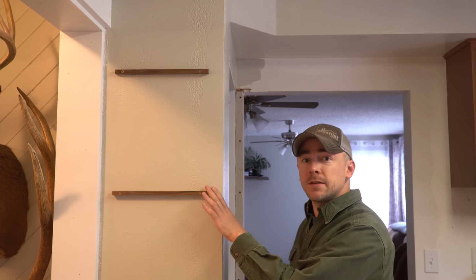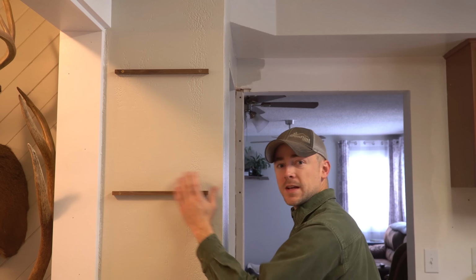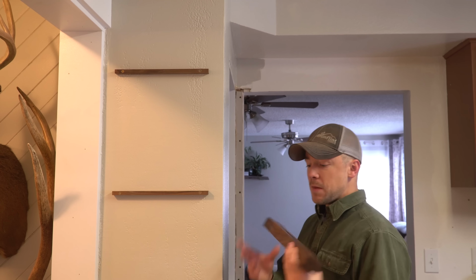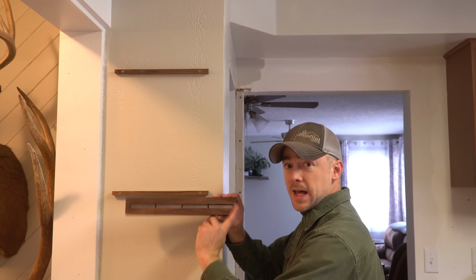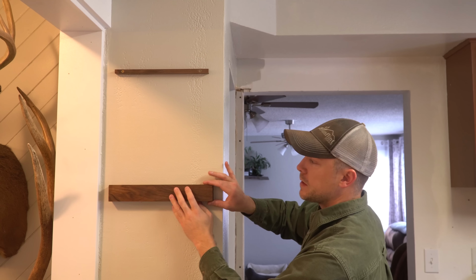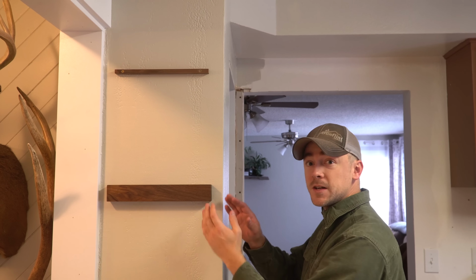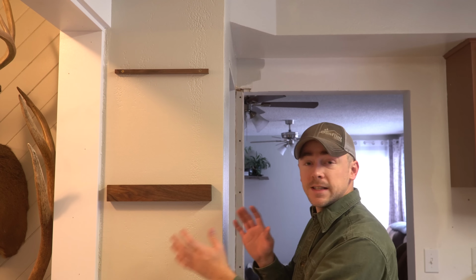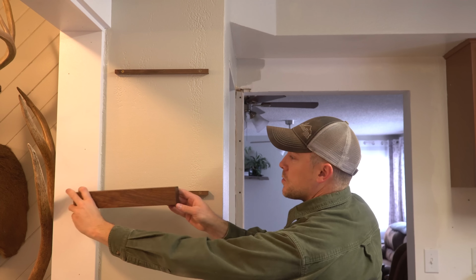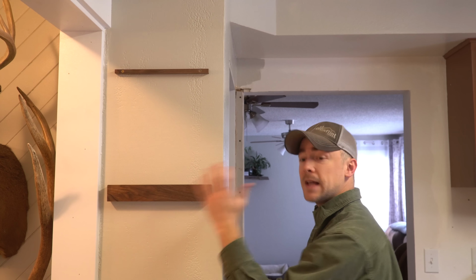So when you go to make these mounting strips, there's actually a little game of back and forth that you have to play between the length that you think it needs to be and adjustability. If you make it the exact width of your slot, you don't have a whole lot of room to work with, but if you make it shorter than that, you have the ability to fine tune the position of this by sliding back and forth. Now, I didn't make it very short because I knew exactly where I needed this to be. But you could make this a couple of inches shorter and have lots of room to move this back and forth before you put the set screws in from the bottom and lock it in place.